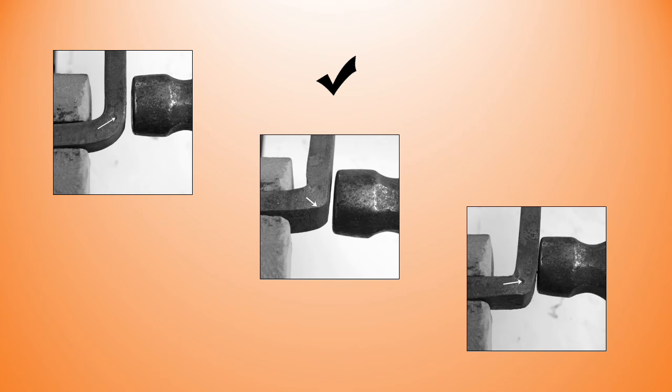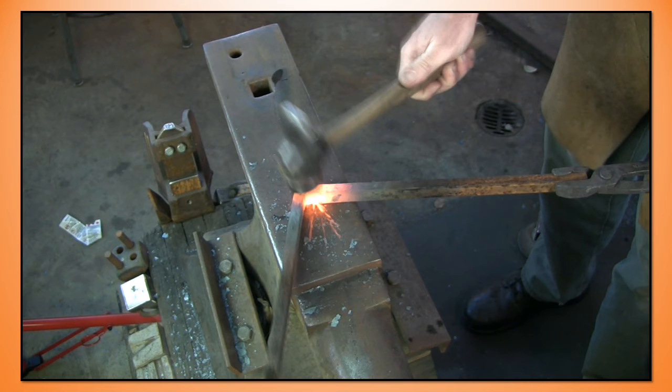And then I close the corner up a little further, and I continue working this way until the corner is formed. Before I get to the point of fully forming the corner, I want to claim some of that growth in width that is formed by the upsetting action. I generally do this at the top of the heat so that I can fully penetrate the bar at the corner, as I don't want any lipping or cupping to occur at the corner material.